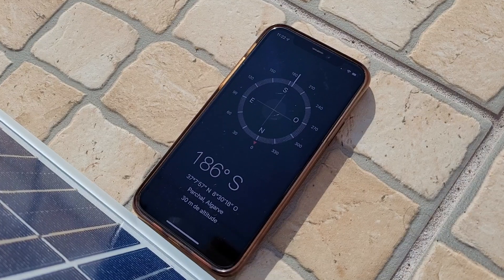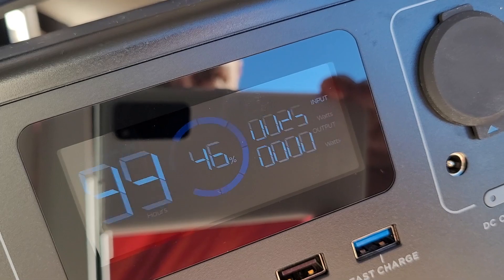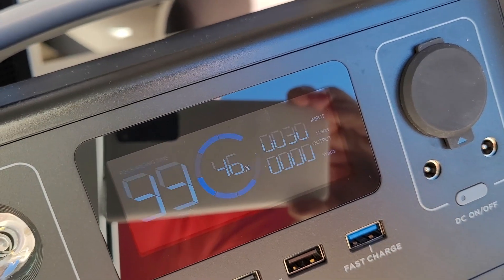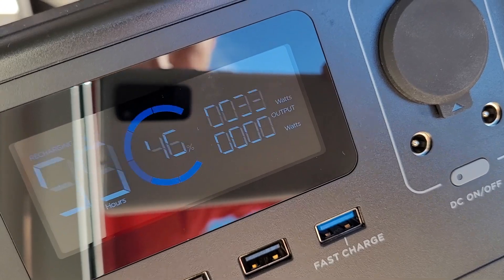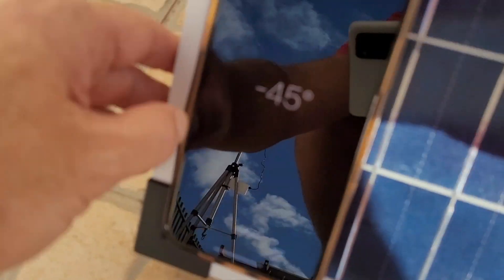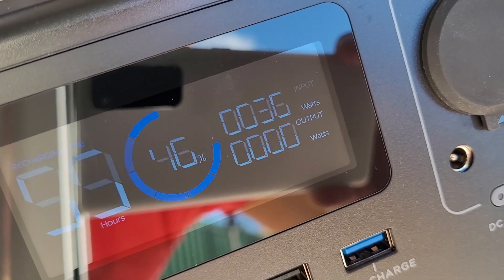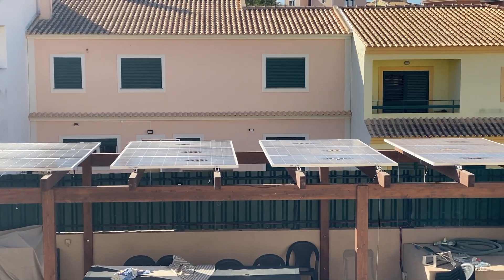Now for inclination: pointing the panel straight south at 186 degrees with zero inclination, I get 25 watts. Moving to 16 degrees gives 30 watts, 30 degrees gives 33 watts, and 45 degrees gives 36 watts. However, 45 degrees is a really aggressive angle and I don't believe it's safe on a roof. In my case with panels at zero inclination, it's a static option, but I'm thinking about raising them in winter and lowering them in summer.